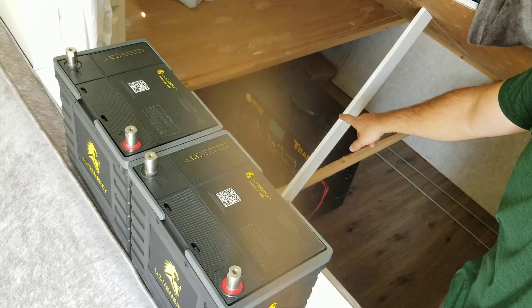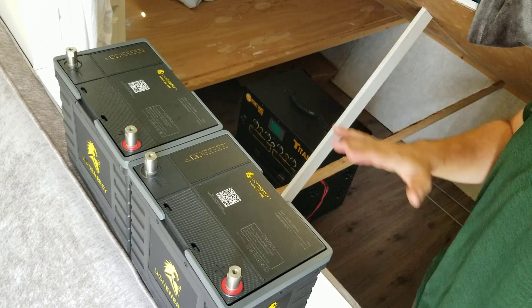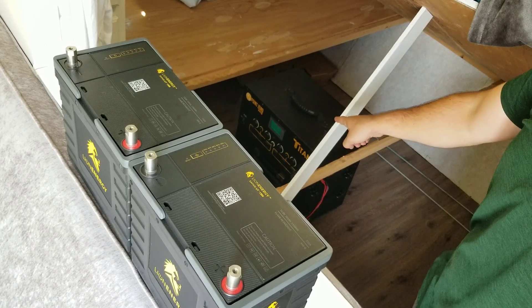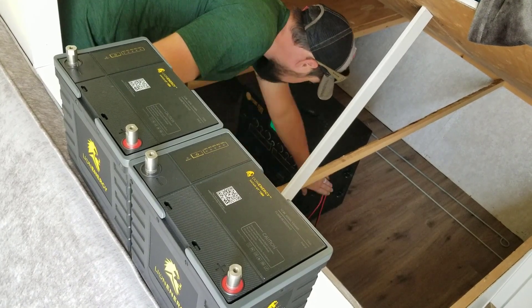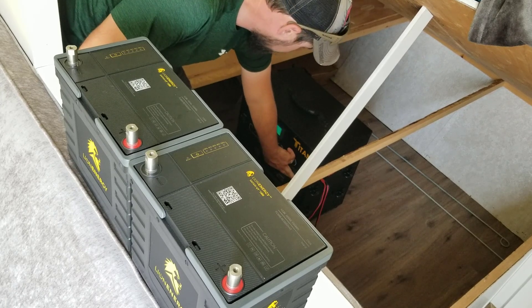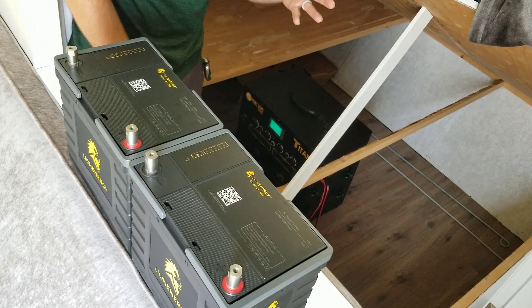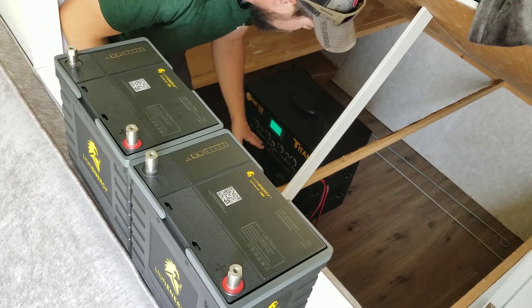You can see I've got my Titan here underneath the bed in my RV. I've got a 27-foot travel trailer that I 100% boondock in with the Titan solar generator. It's really nice because I've got two arrays of solar going in here on the side, and then I just plug the RV 30-amp plug right here on the front, and it runs everything as if I had shore power. This has two Titan batteries, which is 4,000 watt hours.